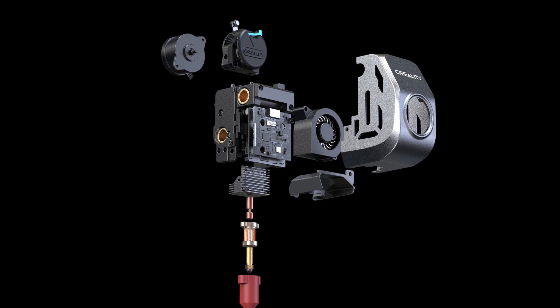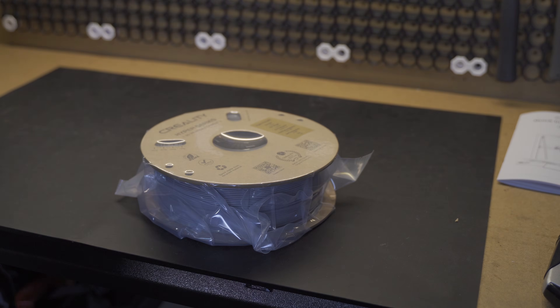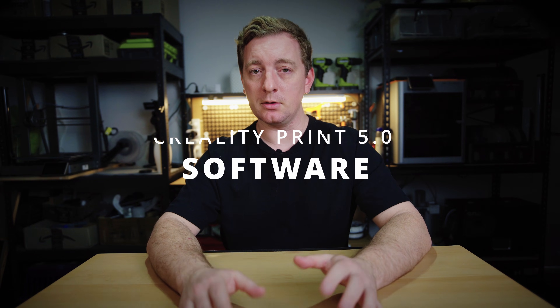The nozzle design allows for super easy swapping and can reach temperatures of 300 degrees Celsius. There are two fans on the print head, front and back, to help with part cooling. The gantry and base are both single die-cast aluminium pieces, allowing for simpler assembly, fewer bolts, and more stability. It's capable of printing PLA, PETG, and TPU, and it could print ABS and ASA, but those would require some sort of enclosure — so it's mostly a PLA, PETG, and TPU machine. It comes with a magnetic-attached flexible build plate, which looks to be a textured PEI plate. I had no trouble printing PLA and PETG without any glue on the build plate, and all the parts released easily once it had cooled down. There is also a 4.3-inch touchscreen which is responsive and easy to use.